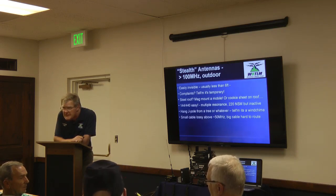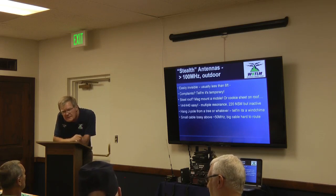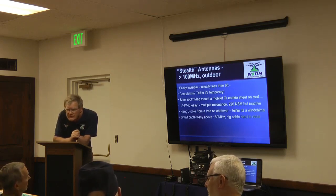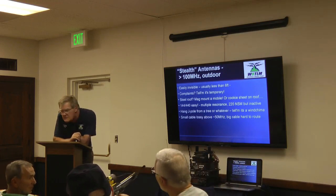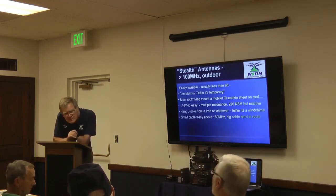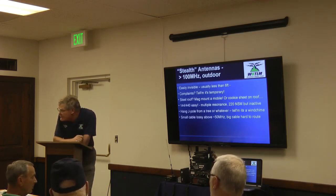So think about that. I'm not going to go into cable tonight because that's another whole semester topic, but cable's important. Generally for HF, smaller cable is acceptable until you get to high powers. For VHF and UHF, thinking about bigger, more expensive cable is well worth the thought.